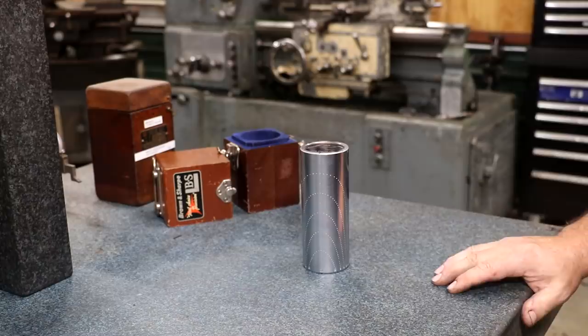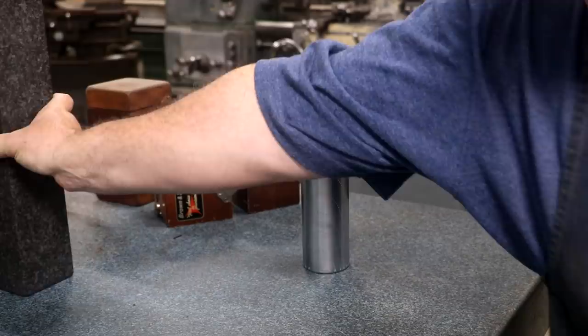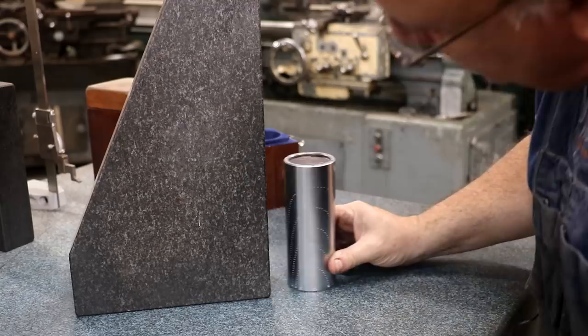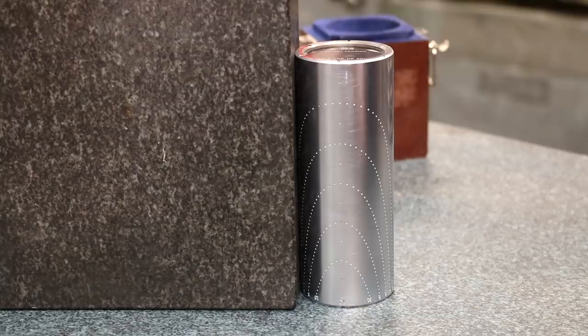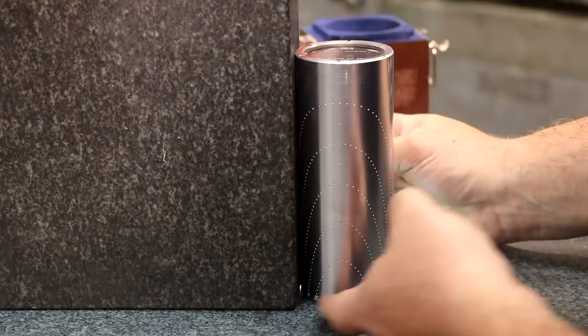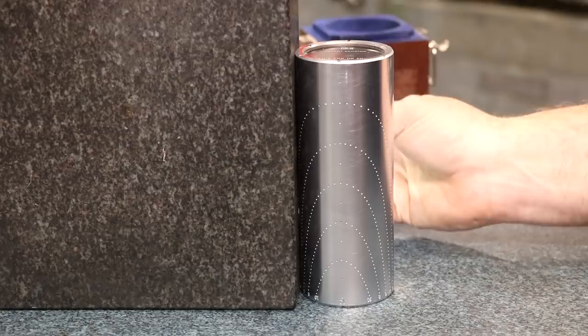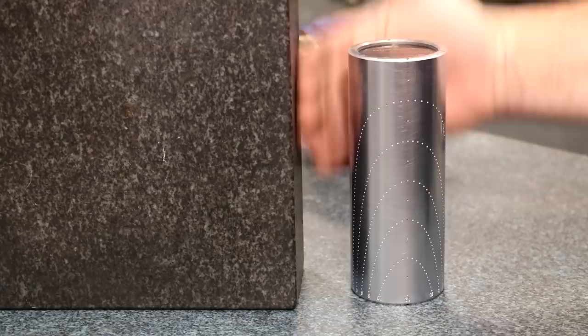What is this useful for? A lot of different things. Over here on the surface plate, you can compare things and see how square they are. For example, I'm going to pull out this granite square that I have, and you can actually just bump it right up next to it and visually see how square something is. The ideal way to do this is to get a light source — I'm just going to take a flashlight and get back here behind it — and look to see if you can see any light in between there. Down at the base I'm seeing a little bit of light, but that's where we got some corners. There's very little gaps anywhere in there. Your eye, particularly with a light beam, can really see something very, very fine. Both of these are reference surfaces, so we're not seeing any differences between them.